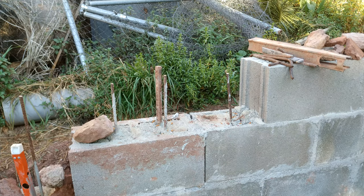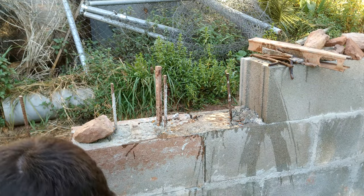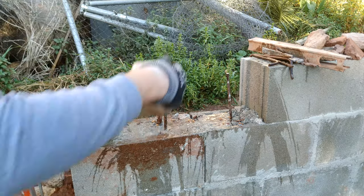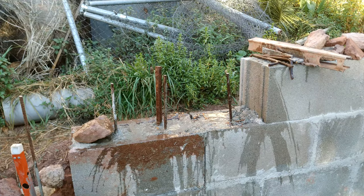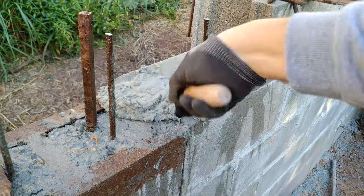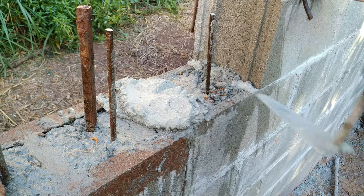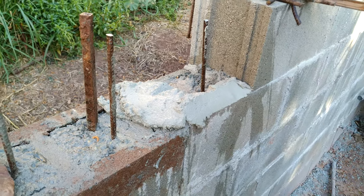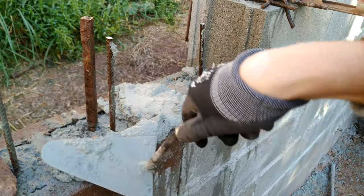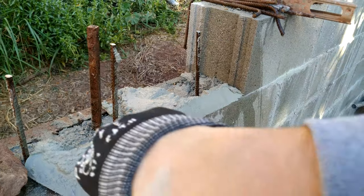We have to make sure to put all the surface wet before putting the mortar. I'm going to place a brick here, so I make all the surface wet. Then I can start to put some mortar. This mortar is not perfect — it's a bit wet, I should do it more dry next time. First I put the mortar on the wall and then I squish it a little bit. Practice is essential to master the palette.